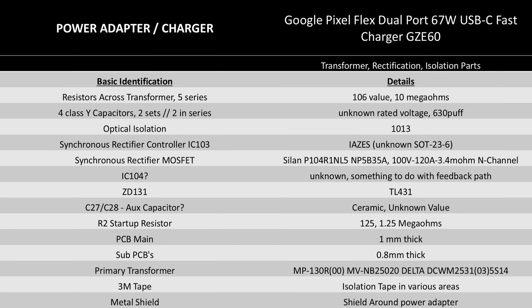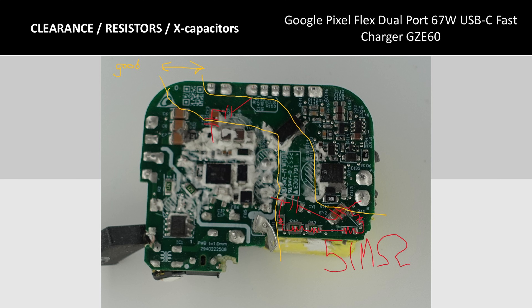Next on the parts list is the transformer and various components for isolation. This uses a very standard optical isolator between the mains and secondary side for feedback control. The interesting thing is the way the suppression capacitors and the resistors across them are set up. There are five resistors in series across the mains to the secondary side. These were measurable with the isolation tester as a 51 megaohm resistor. The actual construction is a bunch of 10 megaohm resistors in series because each resistor can't handle that much voltage without being damaged or arcing. The capacitors, which are in ceramic-looking packages, are made with four total capacitors as a two in series, two in parallel configuration, so you get the same value as one capacitor, but you get more suppression voltage with two in series. I did notice that these were never mounted on the same plane, so maybe some bending mode prevention here, because the PCB is very thin and certainly could be subject to some bending modes.